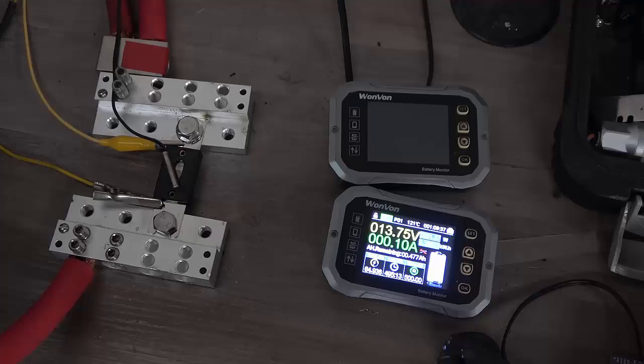So you would think that these would be safe anywhere even close to that current, and you would be wrong. You could very easily begin melting plastic over prolonged periods of time. If you didn't manage to blow the fuse because your current wasn't constant, you could be slowly damaging your fuse, causing more resistance, causing a plethora of problems.